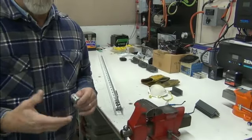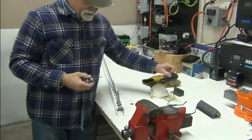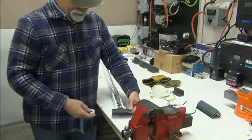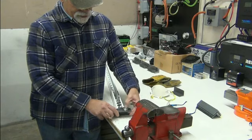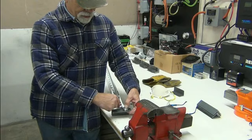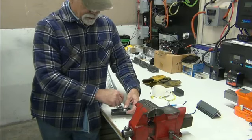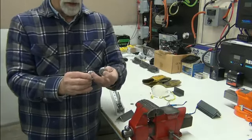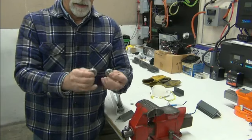The trick when using cables and pulleys is alignment. You don't want things pulling against the pulleys. The pulley is going to sit on a piece like this, and you want where the cable comes around the pulley to go right down the center — so it's pulling perfectly vertically, not at an angle one way or the other. When you have another pulley, they need to be in line with one another so the cable isn't pulling on the edge and wearing against the edge of the pulleys.